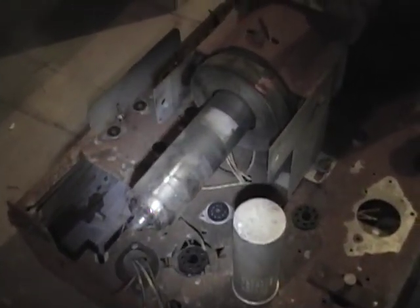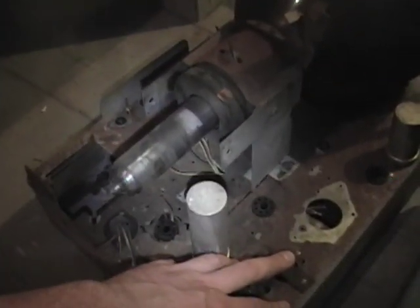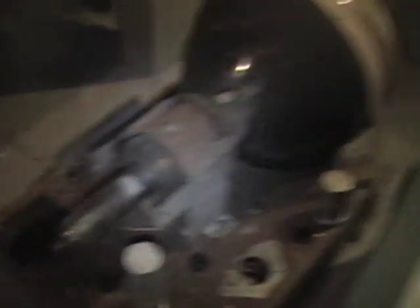He had been using this just as a display piece — he found it in an antique shop and used it for display. It never even occurred to him that it could be made to function again. Unfortunately, to shave weight he stripped most of the parts off the chassis. Also tragically, the picture tube is shot: the cap was removed, the vacuum seal was cracked open, and then to make the tube still look nice it was spray painted an awful white color.